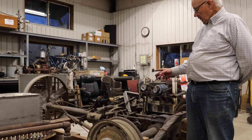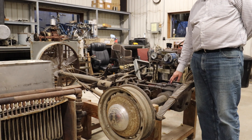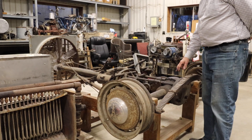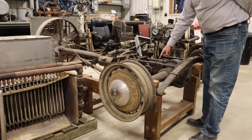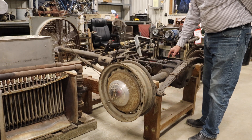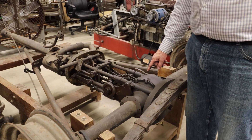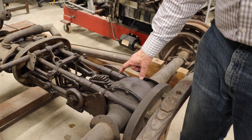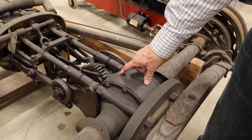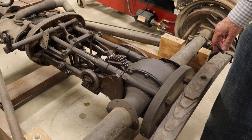This is a 20 horse Stanley from the 1920s which is mated to a 1936 Ford rear axle. It starts out with a bull gear here which is mated up with gear teeth that are on the outside of the ring gear, which is in the middle of the differential. This is a differential case here, there's a differential there. The teeth from here are made up with the other teeth, so there is no clutch.